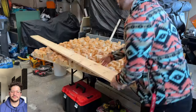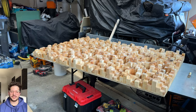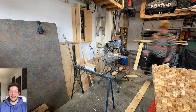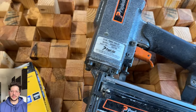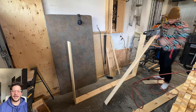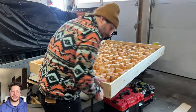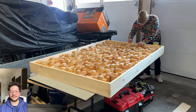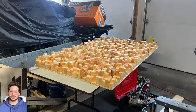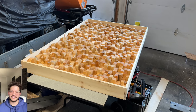There you can see it's all dried and really soaked into the wood. Here's the wood we are using for the frame — this is 1 by 6 by 8 lumber, knotty pine. I'm going ahead and getting all my dimensions because I'm going to cut this frame about a quarter inch proud, meaning bigger than the dimensions of the diffuser. I'm only going to nail it together with two nails to test fit, using a 16 gauge nailer and two inch nails, making sure the front face is nice and straight. I make it a little bit bigger than needed so I can go around and mark with my pencil the exact dimension I need to trim down — if you cut these pieces too small you can't add wood on, but if you cut a little big you can trim down to the very final size for a nice tight fit.